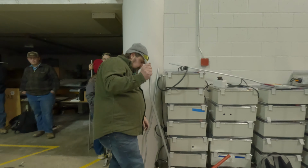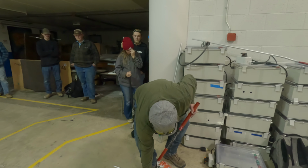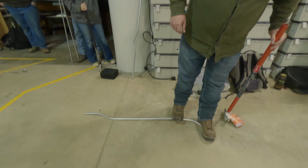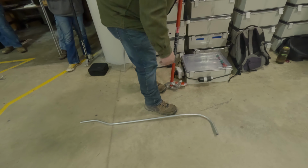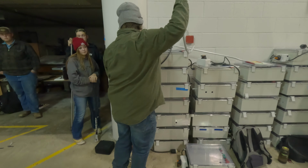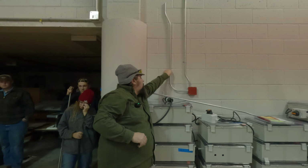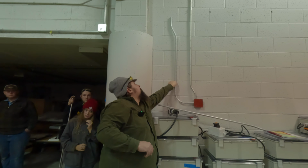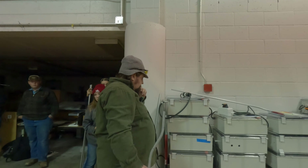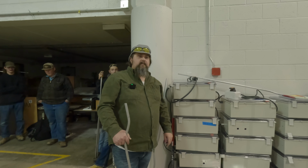If you're over on your kicks, take a little bit out. Just make sure you're holding your 90 so your 90 doesn't get messed up. That offset's messing with me. But as far as concentric with the radiuses and stuff, good luck.